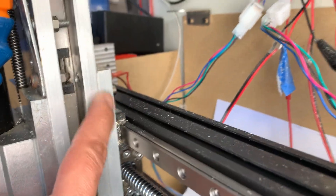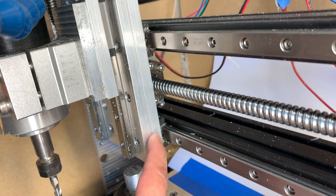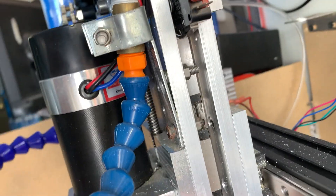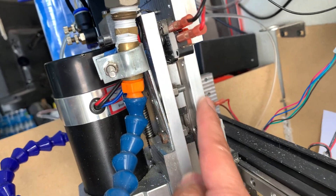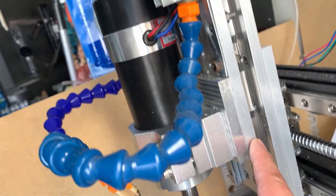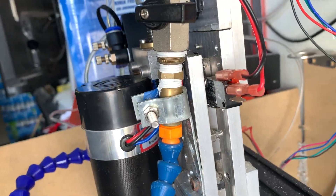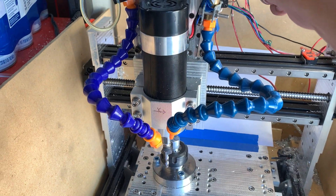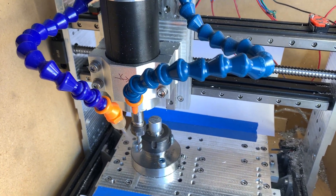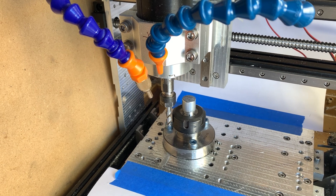So how is this put together? I have a 10 millimeter plate attached to the rails and the ball screw. If I want to change the gantry I can just replace that part without removing the whole thing. I also have a 10 millimeter plate for the rails, a 10 millimeter plate for the motor, and an adapter so I can put any mount I want. I also have an air blast and another line with alcohol in it to keep it cool — makes finishing aluminum really easy.